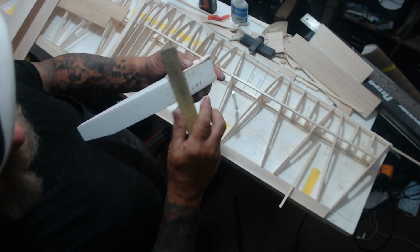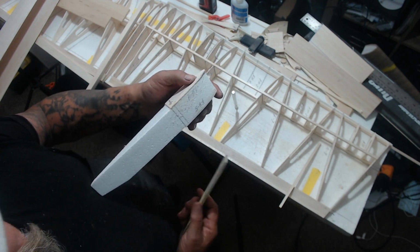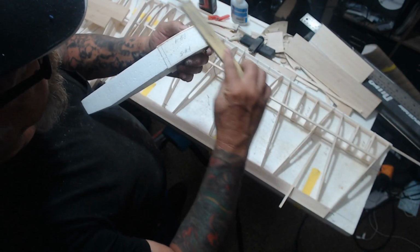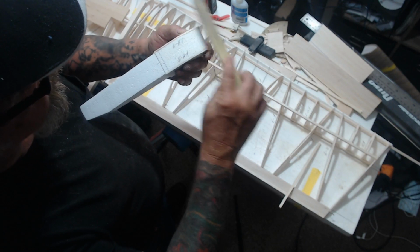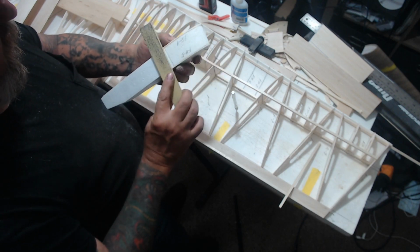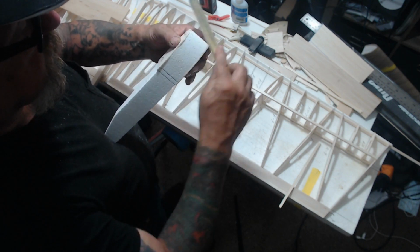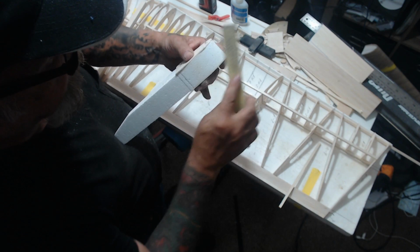And if you want the jig, the buck, to last longer, good wood is very desirable. You want to take some polyacrylic or thinned down white glue and paint the cradles and the bucks if you want it to last a long time. Of course, I'm not worried about it. I bet I got, I don't know, 5 or 6 Geobolt lost foam jigs in St. Louis. I have 3 of these jigs here, so we're not worried about that.